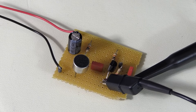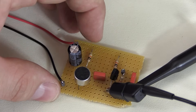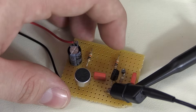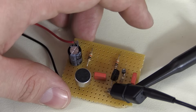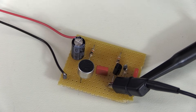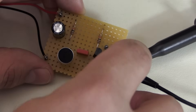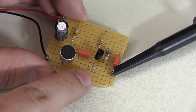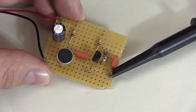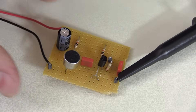Down here we have the little circuit: the big cap for voltage stabilization, the 10k resistor providing supply voltage for the microphone, the coupling cap, a little amplifier, another coupling cap coming from the collector output, going to the output which is connected to the oscilloscope lead here. There's nothing really special about it, but what I always try to do — even in a design this simple — is add a bunch of connectors, even directly at the collector, so I can connect anything to it, be it a probe, supply leads, or anything else.